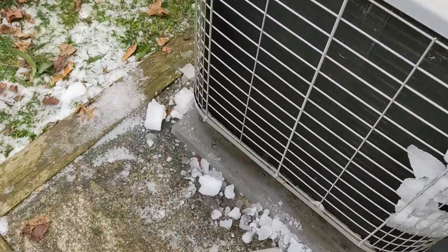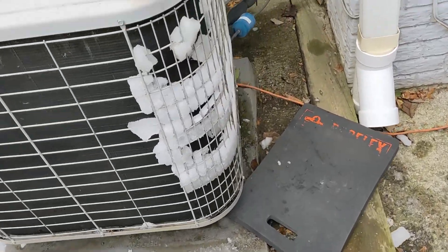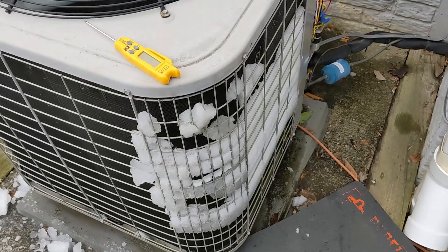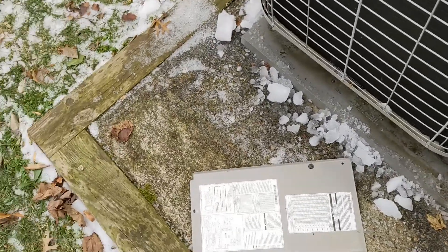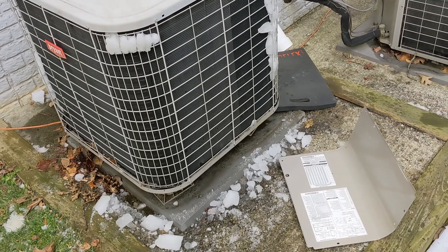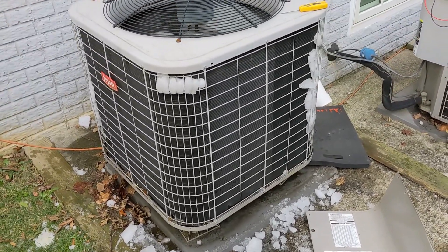So as far as right now, I'm going to test it a few more times, but that was it. Don't know if the board had been changed in the past and somebody just forgot to switch the wiring back. But that's it — it's cranking, went into defrost. I was just going to condemn the defrost board and go about it like that, but just take another minute to look at everything and double-check the wiring diagram. Easy peasy, man.